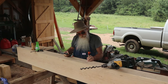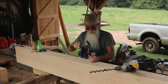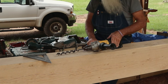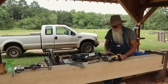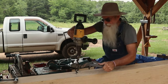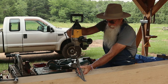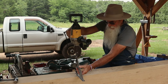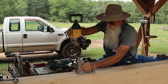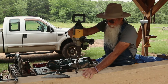I'm using my bigger DeWalt half-inch drive drill — it turns slower and gives me more control. I went ahead and made a little point there so I can set the auger. To drill straight down is something you acquire the knack for — you can set a speed square up and bring your bit against it, but you have to do this in two different directions. Over the years I've just developed an eye to drill fairly straight down.